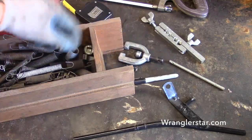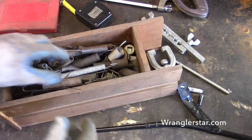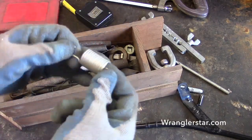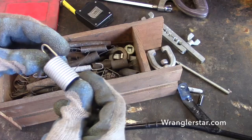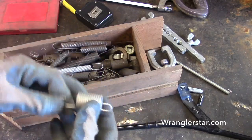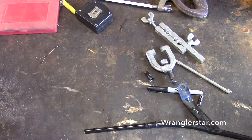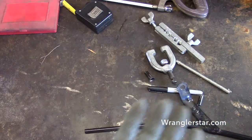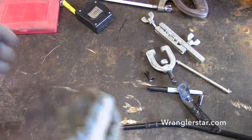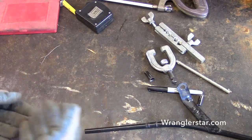I'm going to tension it with one of these really heavy duty springs. We're back into granddad's bolt drawer again — there's a nice big galvanized one. We'll put one of these on the end and that will keep it tight. A lot of times you see these cables done and they're not tensioned right, then they sag and they look terrible. A cable handrail is really nice because you can see through it, it doesn't obstruct your view, there's almost no maintenance to it, and it's super strong.